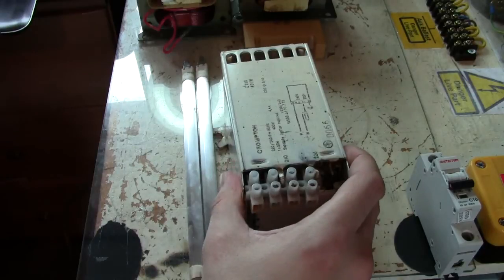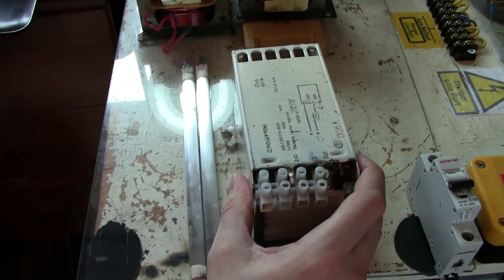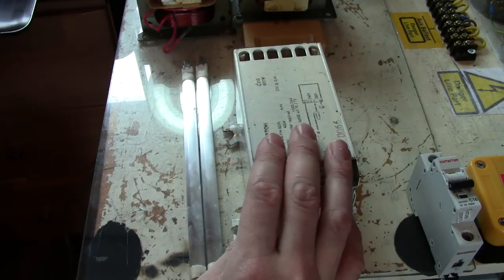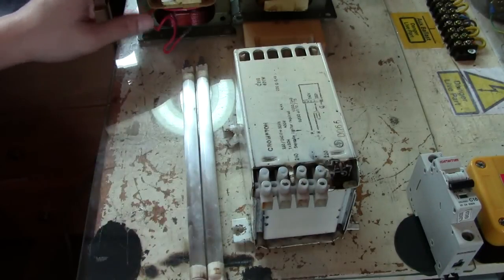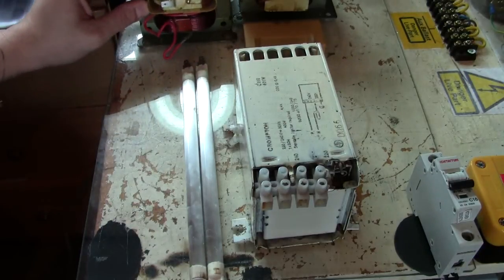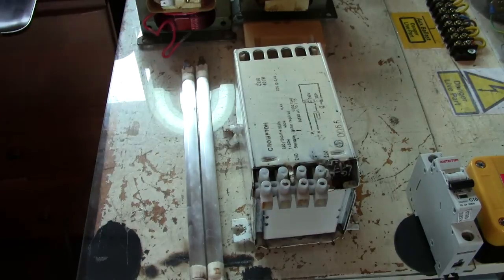But yeah, we've got magnetic inductive ballasts, pros and cons. Okay, I'm going to give you that, how these can put your power factor out, something else that's going to be looked at. So I'm also going to show how to modify an MOT to use as a ballast. Not perfect for if you're doing things like potential transformers, okay.